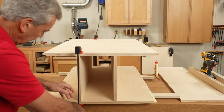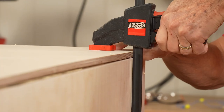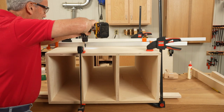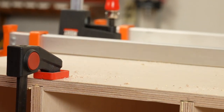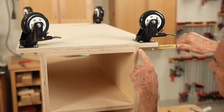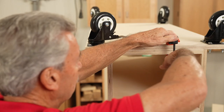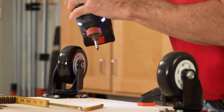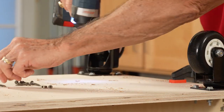Using a series of clamps anywhere the case did not fit snugly, I pull all the sides together. On all the previously drilled holes I'm using a countersink bit to provide a nice recess for each screw, then I put inch-and-a-half screws in all those holes. Flipping the cabinet over on its top makes it easy to locate the base — wheels facing up, squaring each end with a 3-inch overhang, flush with the front and back. I used inch-and-a-quarter screws to attach the wheeled base to the bottom of the cabinet.